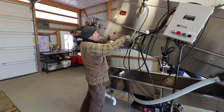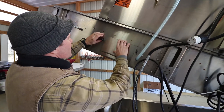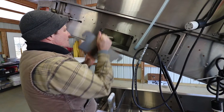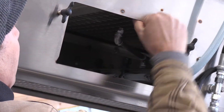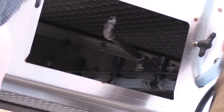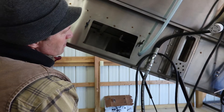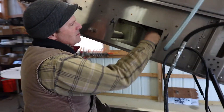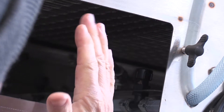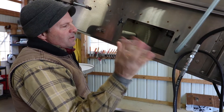I mentioned there are spinning high-pressure nozzles on the bottom of the conveyor as well. You can see the spinning assembly here, and this is the fresh water rinse line — top and bottom high pressure. The pitch on these is adjustable, so this thing rotates, and we're still figuring out the tilt because that changes the speed at which it rotates. Too fast may not be right and too slow may not be right either, so we're still tweaking that.